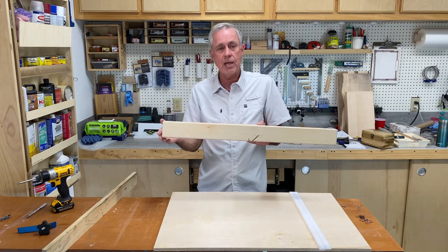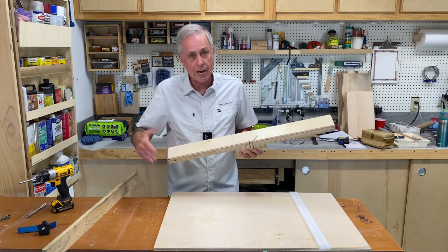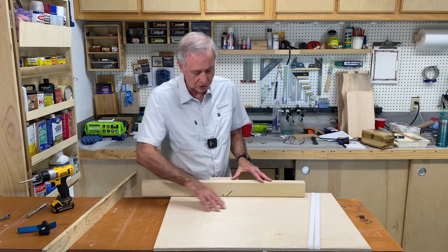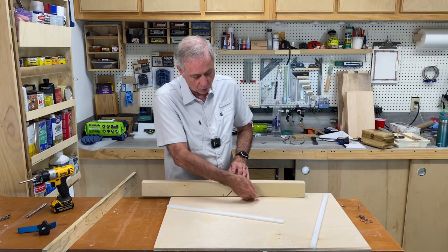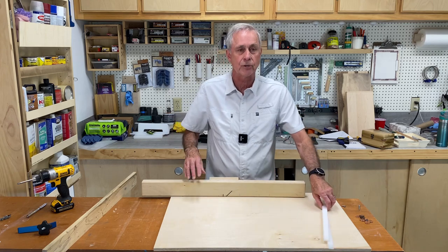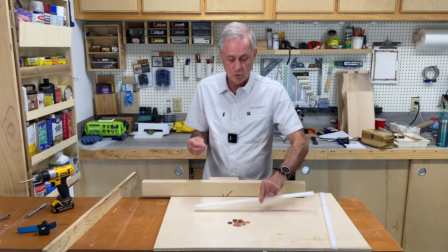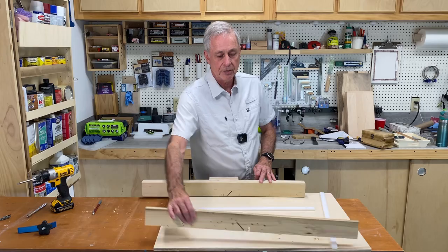I softened all the edges with sandpaper and then routed a little chamfer on the front. If you don't have a router, you could do that with sandpaper on a block — that works fine. The purpose of that chamfer is so that as you're cutting, if sawdust builds up and you put a new piece on and slide it, the sawdust goes underneath that bevel and won't make the cut inaccurate. You'll also need some pennies — I'll show you why in a bit — and screws. I used three-quarter-inch screws for the runners and one-and-five-eighths-inch screws for the front and back blocks.